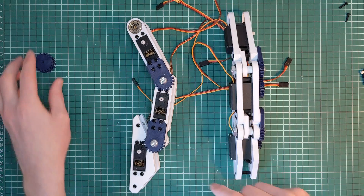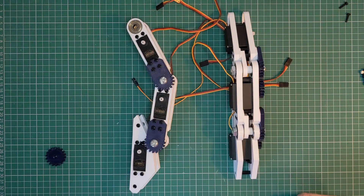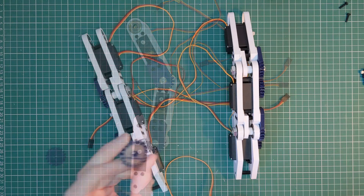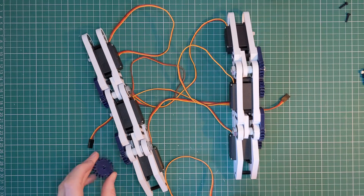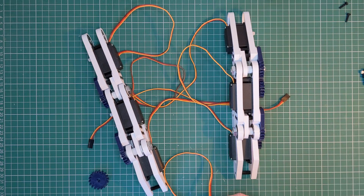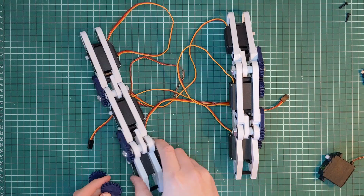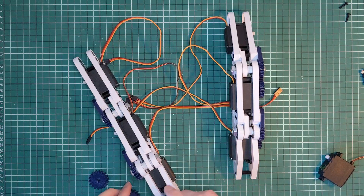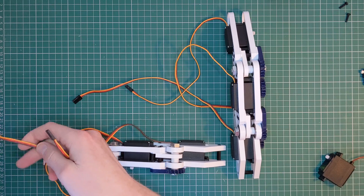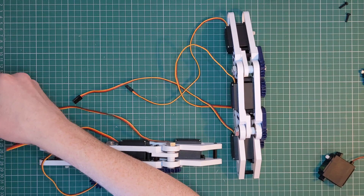The two things that are missing are the herringbone gears. I tried a lot — and I do mean a lot — to get a nice fit on the servo. I got it working, then printed more and it didn't work — just a whole mess. To fit these on I've taken the original gear, which is just slightly too small for the servo, warmed it with a lighter to soften the plastic a little bit, and then pushed it on so it makes a good fit. Before attaching the gears I want to connect the servos and make sure they are all centred and in neutral position — if you don't do that, as soon as you start moving them they could extend past the limits of the device and you end up in trouble.